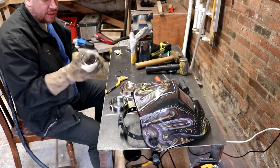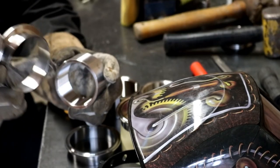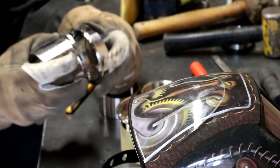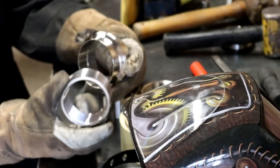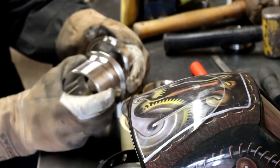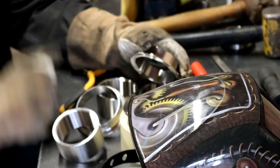stainless steel sockets, and they are to go onto these tri-clamp ferrules. So basically, we'll have one of these on the tank, like that, and then this will clamp on as a tri-clamp does, with a clamp around there. And then the heating element screws into here. So in order for me to get the heating element out, instead of having to unscrew it, I simply undo the tri-clamp, take the element out, and then I can clean it on a bench without having to get in the tank and clean it inside.